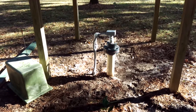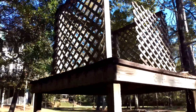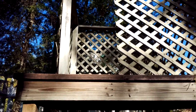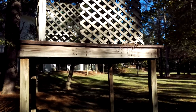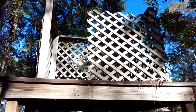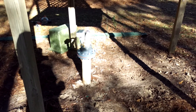This is a well I had to lower and remove the tank. The well was raised up on a platform and the fiberglass 80-gallon standard tank was on top. It was waterlogged, had a leak on top of the tank, and I had to replace the tank and needed to upsize since it was a pretty decent flow well.